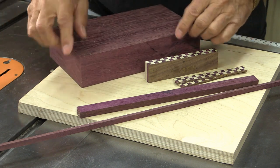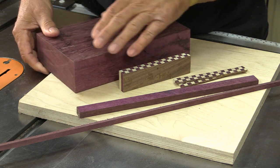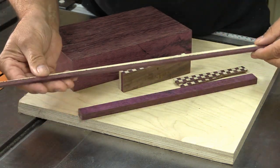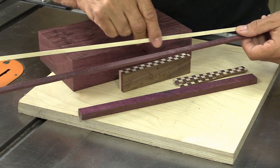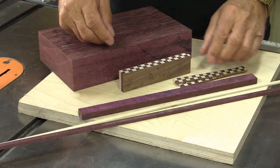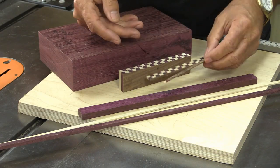I often use a circular saw blade in my table saw when cutting expensive materials. For example, this purple heart is very expensive and I don't want a big thick kerf turning into sawdust. This is holly — I don't have a lot of it — and you can see it makes a nice small thin cut. That's the kind of thing you can do with a thin blade; of course you can get thinner and thinner cuts.